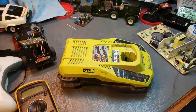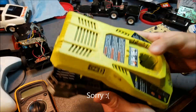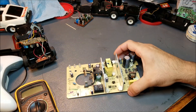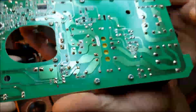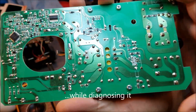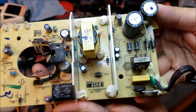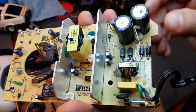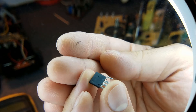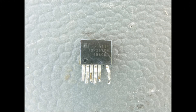Unfortunately I didn't film any of the removal or diagnosis of this unit. The whole unit is contained on this one circuit board. If we look at the underside you're going to see one little scorch mark on the bottom of the transformer — ignore that, that was me. When I opened this unit it passed the smell test, it did not smell burned. Power got through the diodes and the varistors and everything were okay. Capacitors fine. But there was no power going into the transformer, so I knew that this power supply switch was not working.